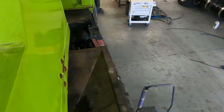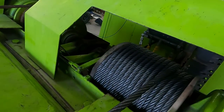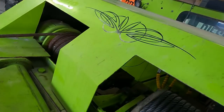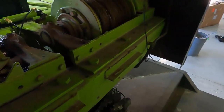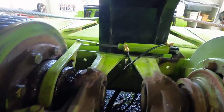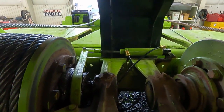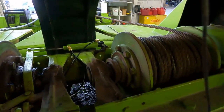We've been putting new cable on it. That's what the old cable was like and this is new — there was 150 feet on it but we've managed to force about 250 feet on, really packed it full. I'm probably going to have to do something to make sure the cable doesn't come off those two winches if we keep that much cable on. I also had to work on getting the drum free spool working. There's a ram that was froze up; I got it operating with the pneumatics, but that ram is just not powerful enough. With just a little bit of a bind the ram doesn't want to fully engage or disengage, so I'll probably have to order a larger ram that can put about twice the pressure — these are some really old winches.